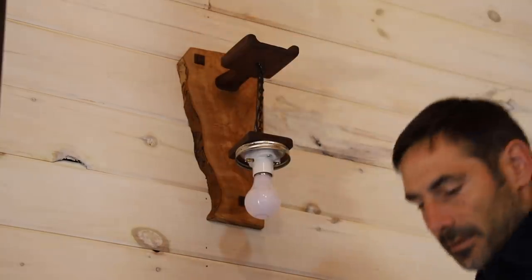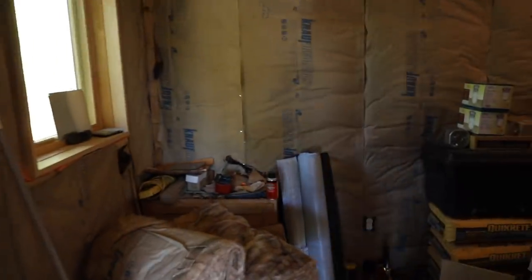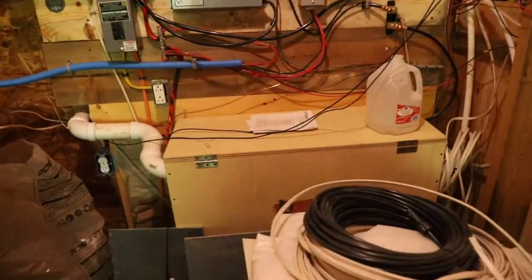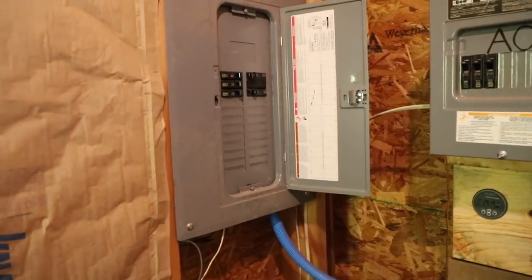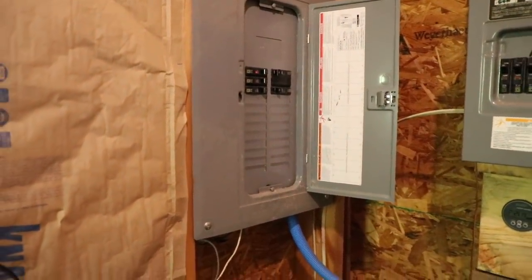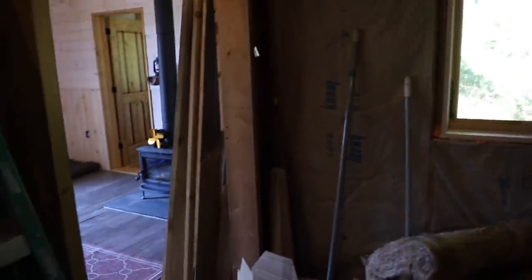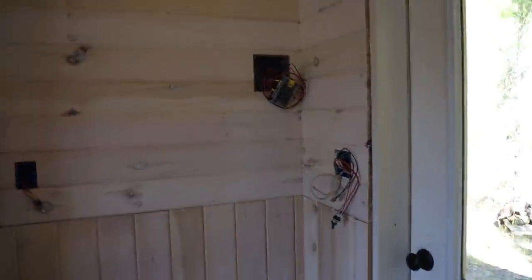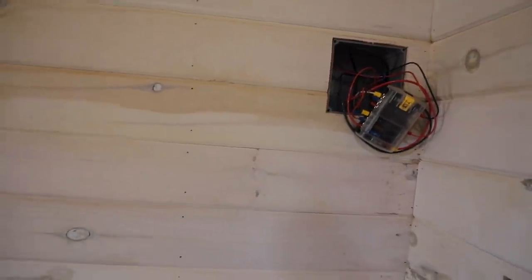Let's get power to these. Quick refresher for new viewers — this is my power center. It's solar, this is my battery bank, and this panel here is my main DC panel. It distributes DC power to major uses and to sub panels. From this panel I've got a wire that runs over here to a sub panel. Due to the nature of DC power, it's easier and cheaper to run circuits on one side of the house off a sub panel.